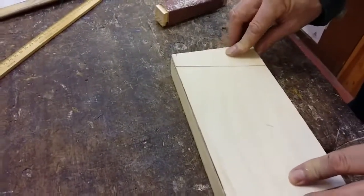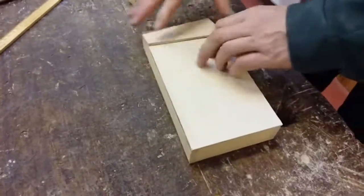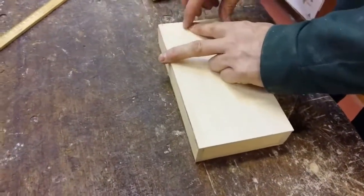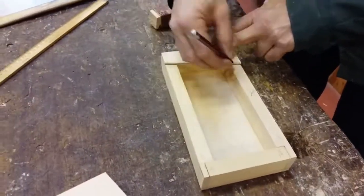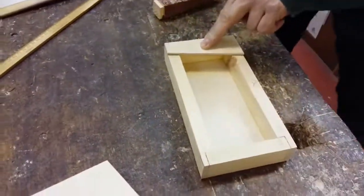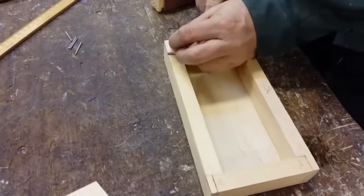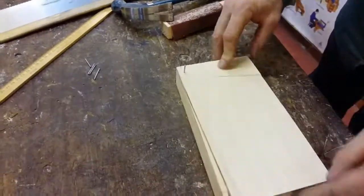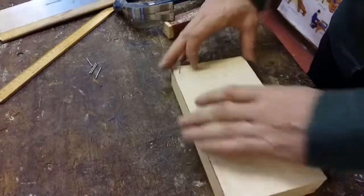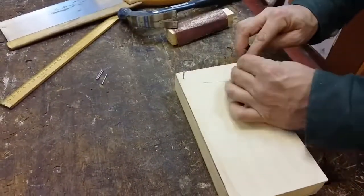Now when I push them up to the edge here, I want them in line - everything flush along these sides. And because the saw cut has been removed you can see now why we allowed the extra thickness of the saw cut. Placing the piece here I pencil two lines which are guides to make sure if it moves I can place it back. Also because I'll be gluing this, I take one pin and just through the surface into the next. You can see if it moves I can adjust my piece making sure that it's flush on the two sides, which means even.